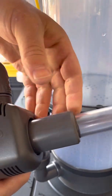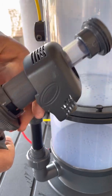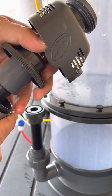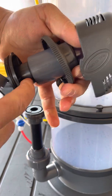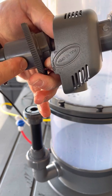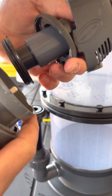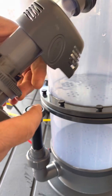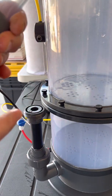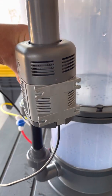It's really important that you note this: these CJ pumps have a little fairing that goes over the volute here. This is actually a female thread and this is a male thread. If you over-tighten this, it's got to be tight because of how the gasket works, but if you over-tighten it you're going to crack it. The good news is they make those parts readily available; bad news is they probably make them readily available because they crack so easy.